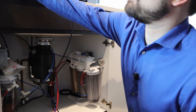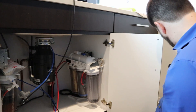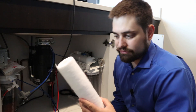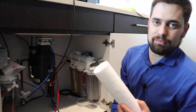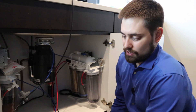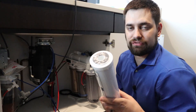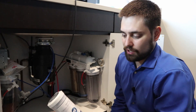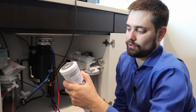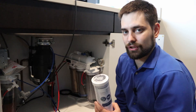The filters I'm running — I basically have three filters here. I have a pre-filter, which is filter floss at five microns. It helps clean up some of the sediment and prolongs the life of the downstream filter. The next filter is a five micron carbon block filter — a charred coconut type media from Bulk Reef Supply. It's for chlorine and volatile organic compounds, but it's not the specific filter for chloramine.